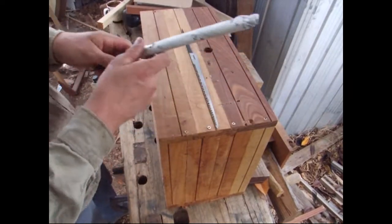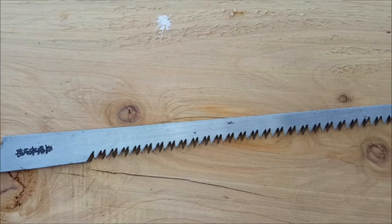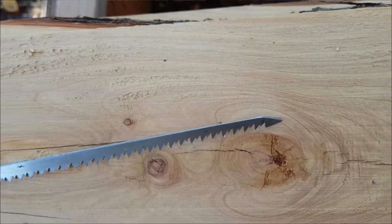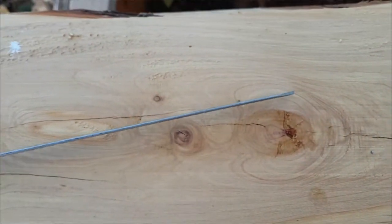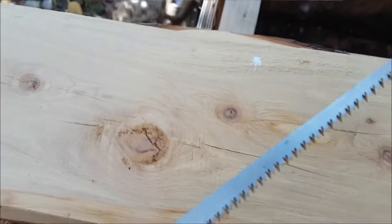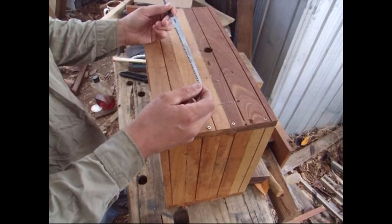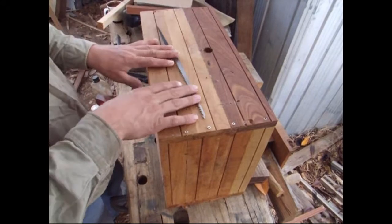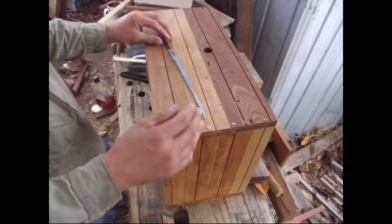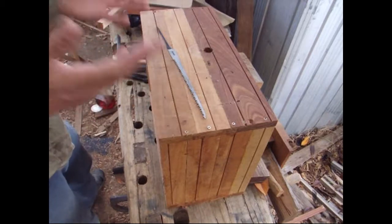And that's why I'm going to be using one of these beauties — a Japanese compass saw. These ones in particular are blacksmith-made; these are not your disposable Japanese blades. It's got quite a thick spine, which does mean for this sort of work it's going to leave quite a big gap, but needs must. You do need to start it with a penetrating hole. I've never used one of these before — I've got four blades and I got them to try and sell. You can resharpen these, so if they don't sell, I've got a life's supply.